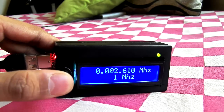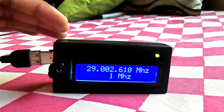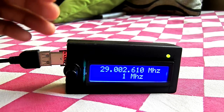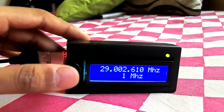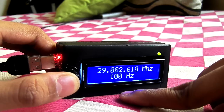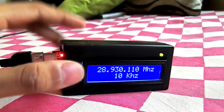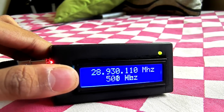You can set it up to 30 MHz of frequency and basically tune to any kind of frequency. The actual DDS chip I used can go up to 40 MHz, but after 30 MHz or so the waveform gets dirty, so it's better to use it under some limitations. As you can see it can go up to 30 MHz — it's now at 29-point-something. You can tune the count by pushing the rotary encoder, so you can fine-tune the frequency quite easily.